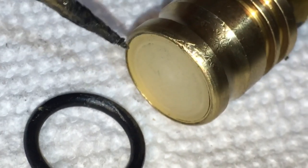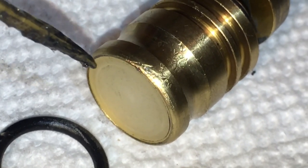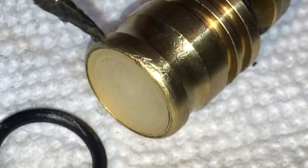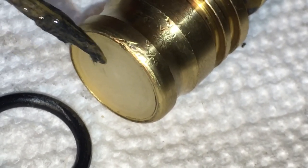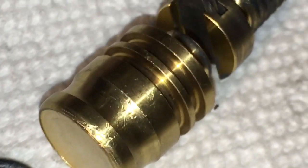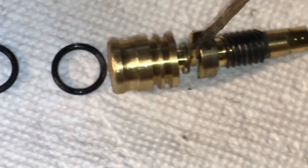That's a nylon seal — they used to be Teflon, but it gets damaged too easily. Nylon is a little tougher. It doesn't seal as well with less pressure, but everybody over-torques them and damages them. Under vacuum sometimes this would not hold — how they smash it over to hold this little disc of nylon in there. This little disc would not hold Teflon because Teflon is soft. You would have a good deep vacuum and a good seal, but when you went to open up your valve and back it off, the Teflon would actually stay sealed inside and come out of the bore.